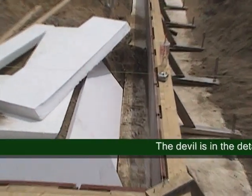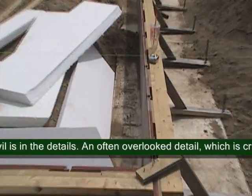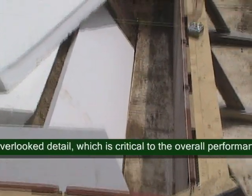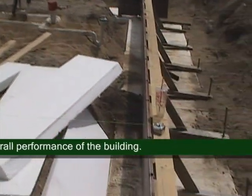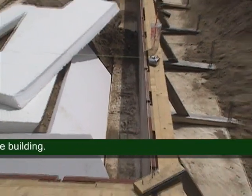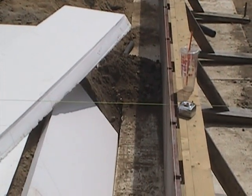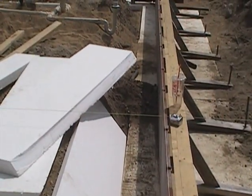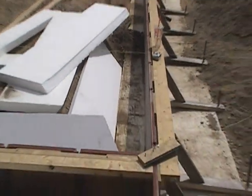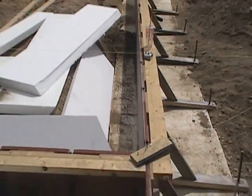Here's a little view of what we're doing on the inside of the trench. We have the geofoam completely underneath our forms — it's covered in dirt right now from digging out along the edge. Then we're putting styrofoam sloped to create our footing space. That's going to come up to the plateau and then have flat insulation over the top. So we've created a one-foot wide sloped footing area around the perimeter of the building. Any little voids we see, we're going to go around afterwards and fill with some spray styrofoam.